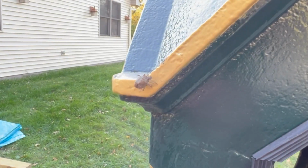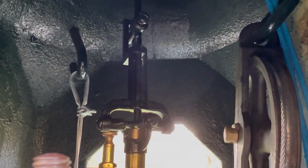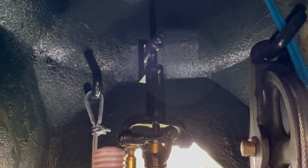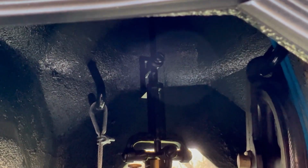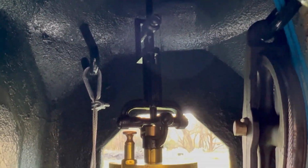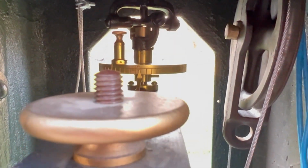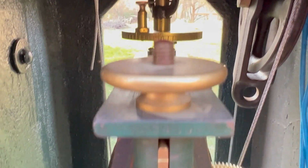So the minute adjuster there, got that synchronized with the hands on the clock. Got a little bug here checking out what's going on. There's at the top here a U-joint set up, and then the shaft that runs down from the dial, there's a little dog that drives the slot, which is how you slip the hands so that the setting dial matches what's up above. And that's the basic operation.